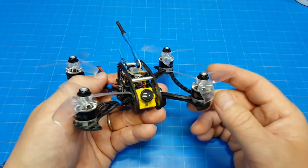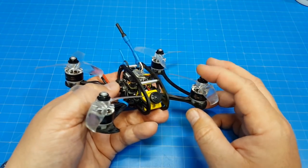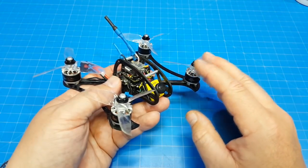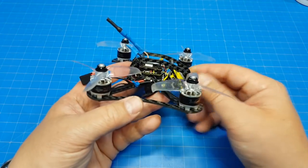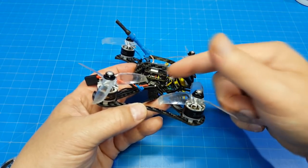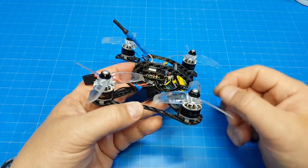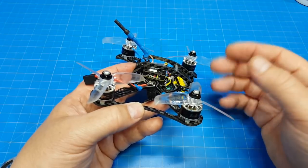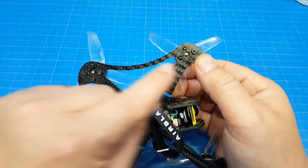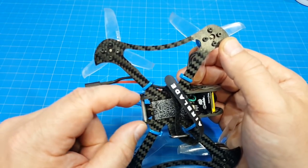And that's important to note because Dimitri will honor the lifetime warranty if you build the frames with the recommended components. Another component that you could use instead, if you're not a fan of this flight stack, you could use the Zeus board in there if you're just going to run 3S on something. Maybe you've got an 1106 motor or 1107 motor you plan to try. This will fit those various types of motors because they do have these slotted brackets.